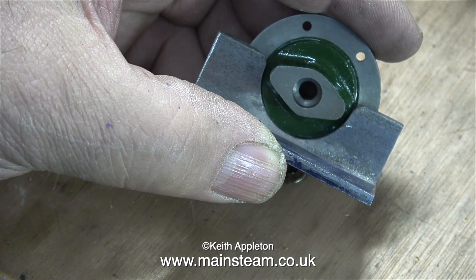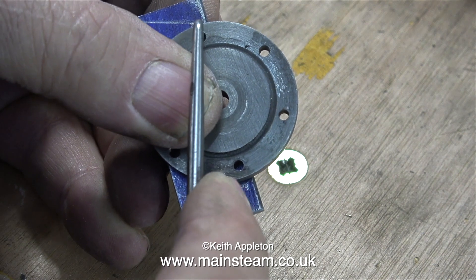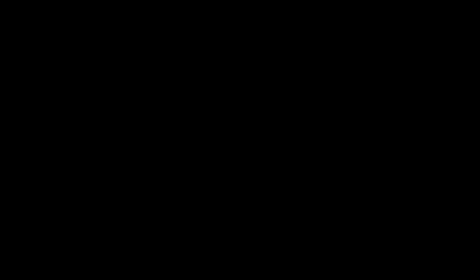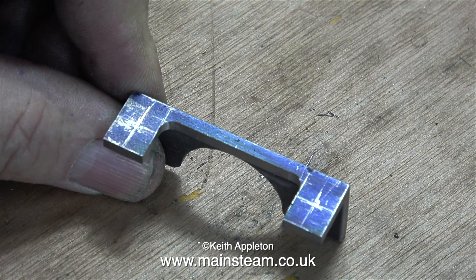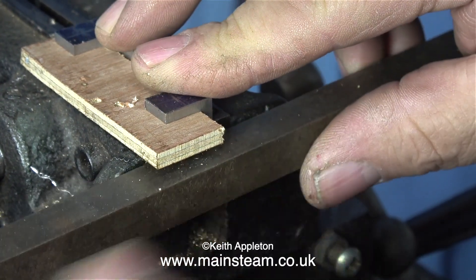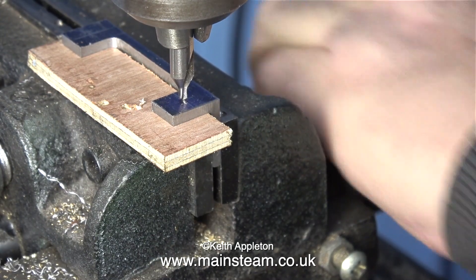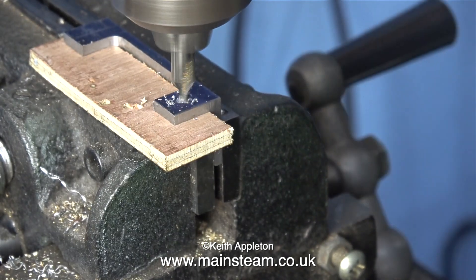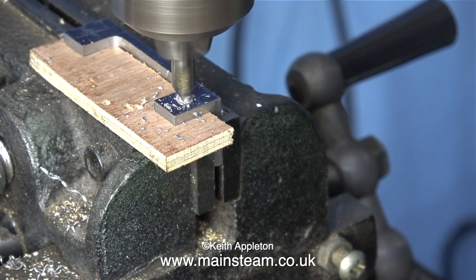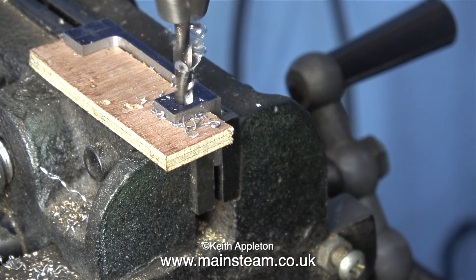Time to hold the bracket against the cylinder cover to see how well it looks. I've turned the cylinder cover over and I'm marking out from the inside where I'll drill two holes — this is how the cylinder will be attached to the bracket at this end. I'm using a piece of 6mm plywood to give me a bit of tolerance when the drill breaks through. The positioning of these holes is critical; I'm using a substantial centre drill first, making sure it's exactly on the scribed line, then I changed to a 3/16th of an inch diameter drill bit and went all the way through.